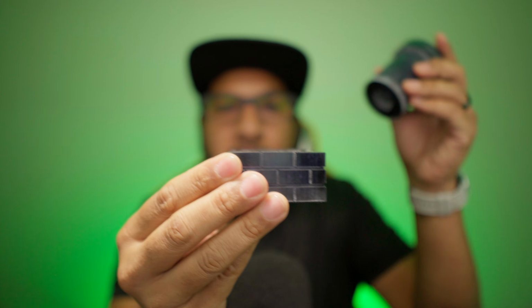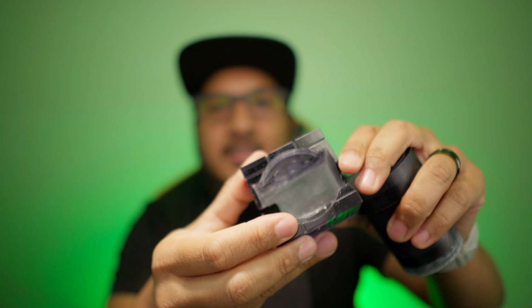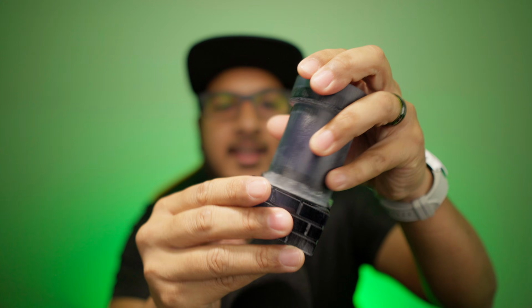Now, if you download a nice case and your board fits, but you have to bend the pins on the ESP32 slightly just so the case closes or something, do not do it. Don't do it. It is going to be a disaster. I did it with this one right here because I didn't have enough space on the top. So when I put this, the pins were interfering with it. So what I did was I bent the pins so this can fit on nicely on the top. And it was an absolute disaster. It was not working. I tried troubleshooting it for hours on end, could not figure it out until I eventually wised up and decided to unbend the pin. Magically made it start working again. So don't bend the pins.